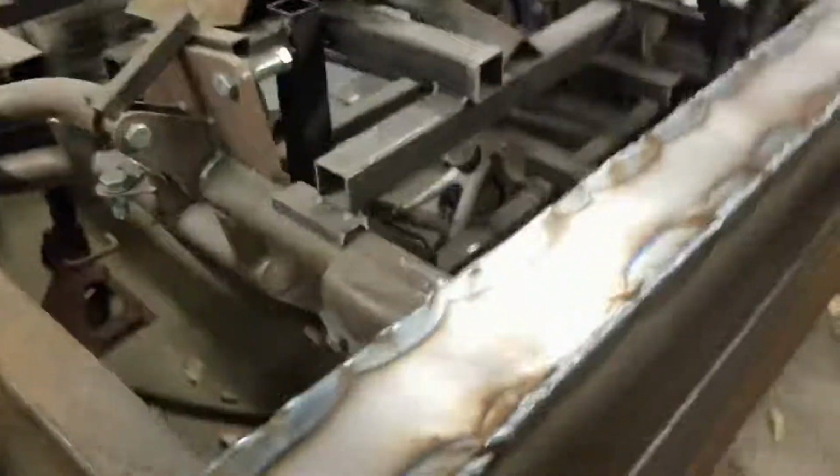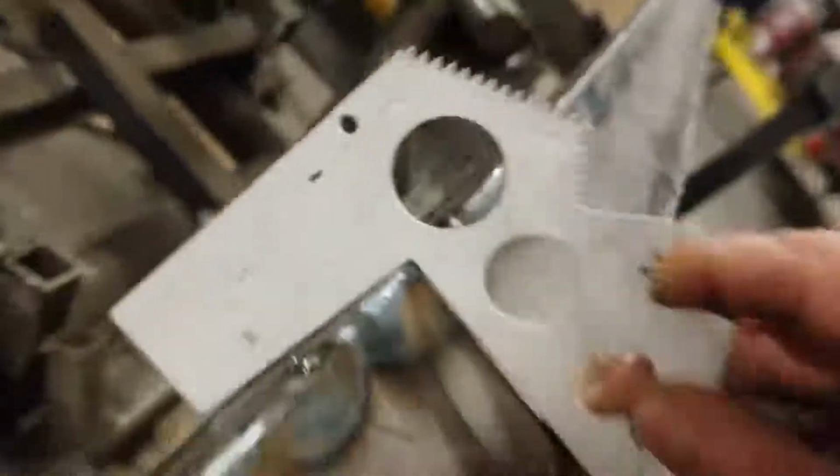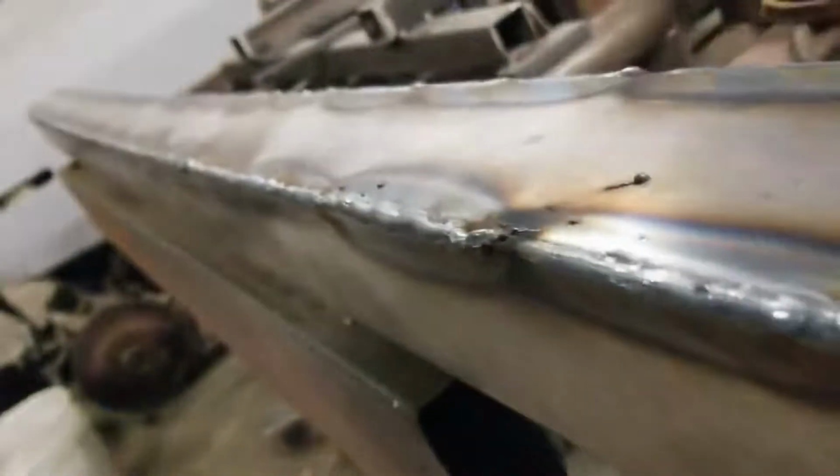So when you lay it down in there, you put it in there, and then you just look right down through there, right? See how it's lifted? That means you've got enough weld that when you go to grind that smooth, it's going to have a corner. Now, I'm doing a rounded edge on this one, so that way I can match the actual edge down here. So I don't want a perfectly straight edge.